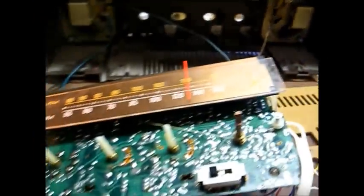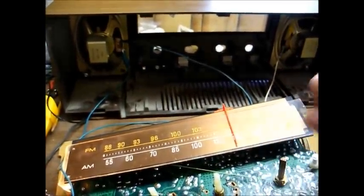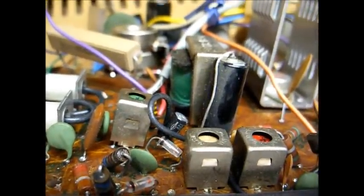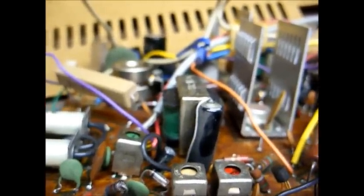The AM is more in line than the FM is. I still haven't solved the oscillator problem yet. But you notice this transformer right here — or coil — is not seated very well on the circuit board. Same goes for that output transformer down there. So while we're waiting on a schematic for this to arrive so I can fix the oscillator problem, let's seat these parts on the circuit board in a neater fashion.